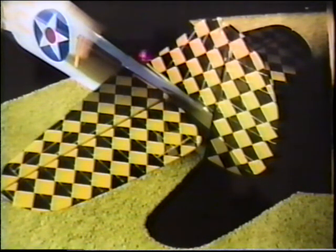But the nose art here is just astronomical. The cowl is held in place by one screw on each side. This keeps the cowl from spreading out, caused by engine heat inside the cowling expanding the wood grain. Well, let's hope it doesn't expand the fiberglass too.